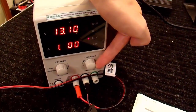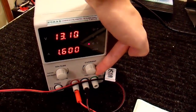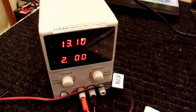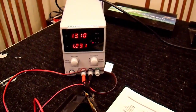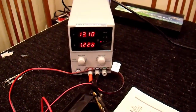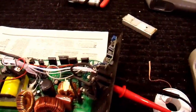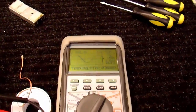It's not a good sign, but it is also possible that the inverter requires more than 1 amp — at least intermittently — to function properly. So I'm going to crank up my current limit to 2 amps and give it a try again. There you go. Takes more than 1 amp to run — takes 1.2 amps at idle. And it outputs 122 volts AC. Let's take a look at the waveform just for fun. There's the waveform: a nice clean sine wave, like it's supposed to be out of this inverter.